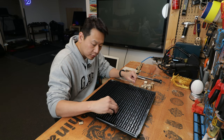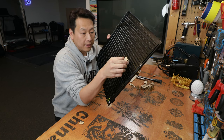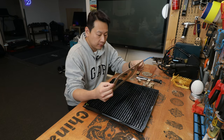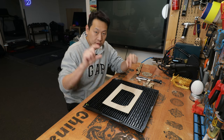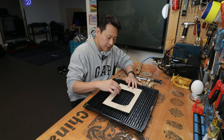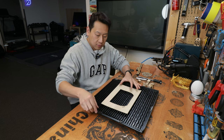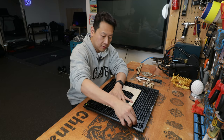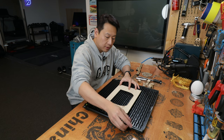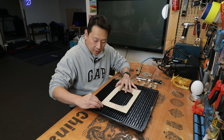Once you have these pieces, you just push them down. Now because they've got an overhang on the ends, they get caught by your work piece. I make the overhang as little as possible so that I can really engrave to the edge. Like I said in my last video, the X20 Pro is really good at cutting and the focus length is quite wide, so even if a piece is a bit wobbly it will still cut straight. You can also get rid of the wing nuts or screws altogether and just press your own little table slot down.